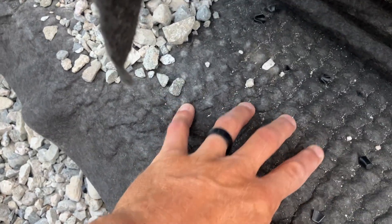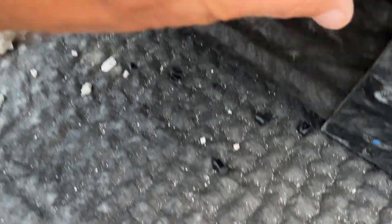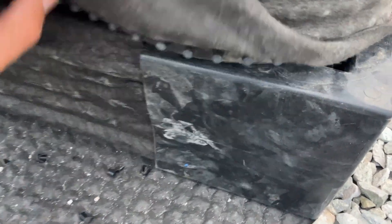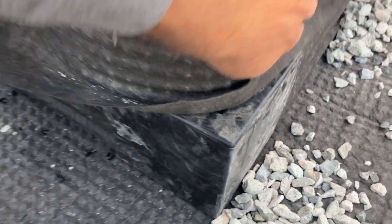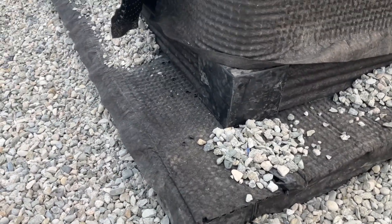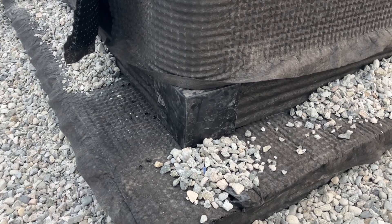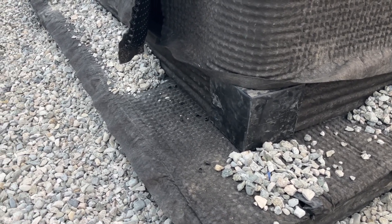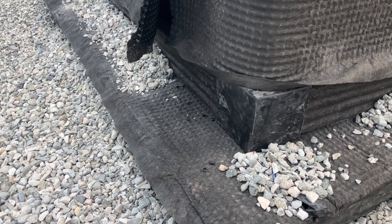The SWD drain has these fittings — a corner fitting that's six and a half inches tall — and it goes around the corner. You fit that piece, cut the SWD material, and push it in there. That takes the corner, and I'll also show you the transition where it actually comes out into a pipe on the other side.